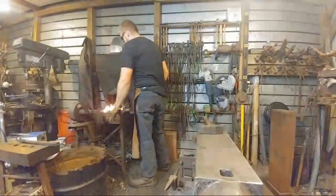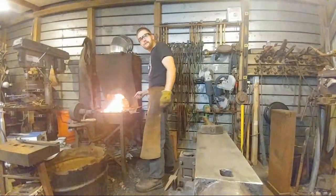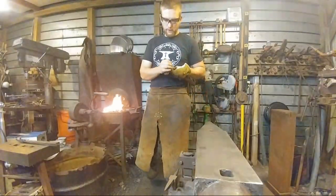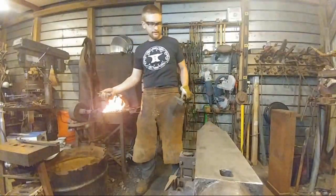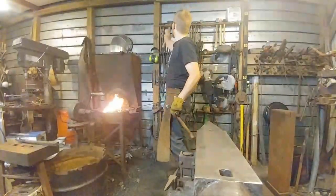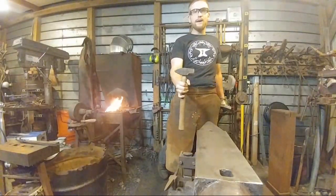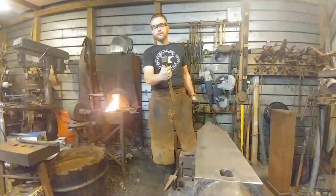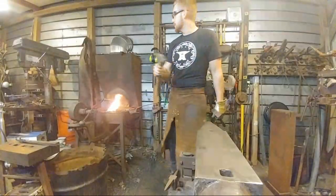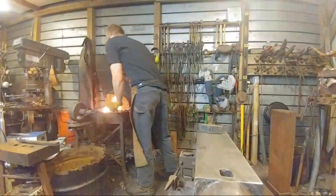Cody Dixon said, why are you using that weight hand hammer? Because I can swing it all day, 12 or 14 or 16 hours or whatever I must. That's why I use this weight. I don't use really heavy hammers anymore because they destroyed my wrist. That's what I consider my 3-pounder. I'll use that if I have a lot of material to move, like 1-inch stock or so. I'll try using it for a while, but I can't swing that one all day. 1¾ pounds, I can swing just fine all day long.